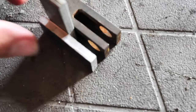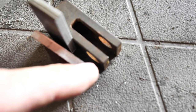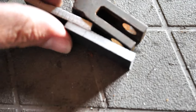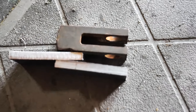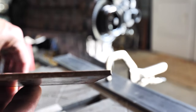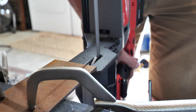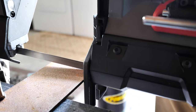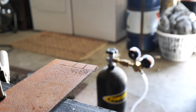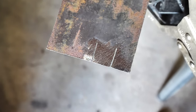Here is the new piece, here is the old little flange piece - and that is like the perfect fit right there. Ideally we want this thing to look something like this, but we need to take up this gap. We need to get the right amount of material in between so we can weld it all and make this thing work. I have this little flat plate - if I cut two of these and stack them it is going to be the exact same size. Real quick before I cut this totally off, I'm going to clean up the metal. I'll flip it and finish the chop.